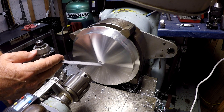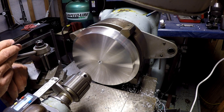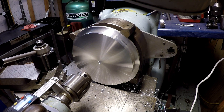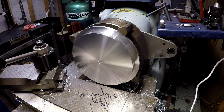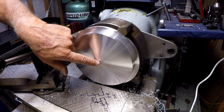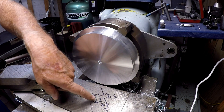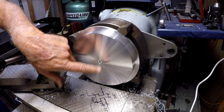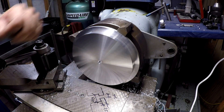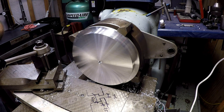I've got a little chicken scratch down here to get things straight in my head. I'm going to punch a hole all the way through at 3/8 — 0.375 — and then leave a quarter-inch lip, so my 0.625 hole will leave a quarter-inch lip inside one inch. I'm going to go in three quarters of an inch deep.